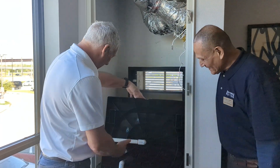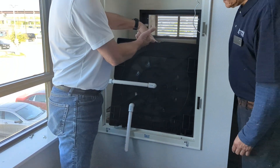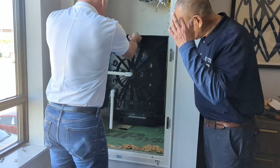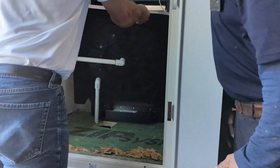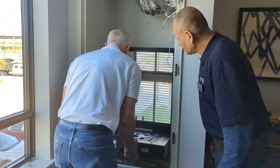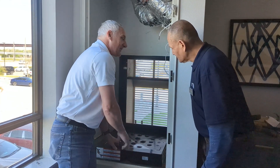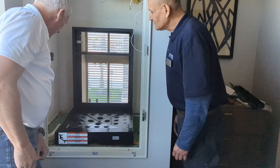We have our plumbing installed for our primary drain and our secondary drain. The secondary just goes into the wall plenum — that way if it leaks outside, you know you've got a clogged drain and need to address it. We'll make sure our secondary goes through this opening here, then lift up the platform at about a 45-degree angle, drop it, and lock it into place. That integrates the platform with the plenum so it won't move, and we've got our primary drain lined up to drain properly.